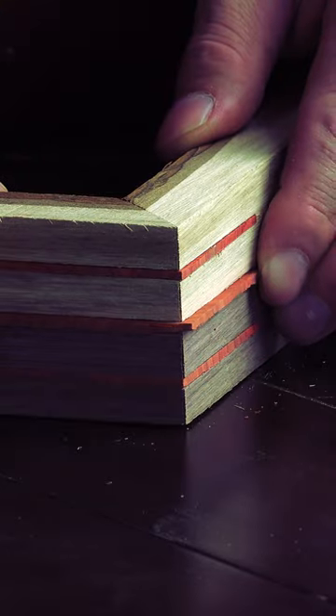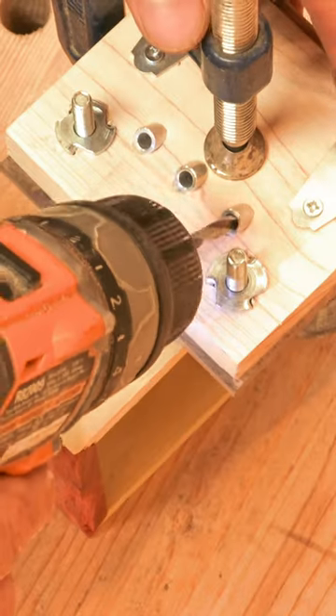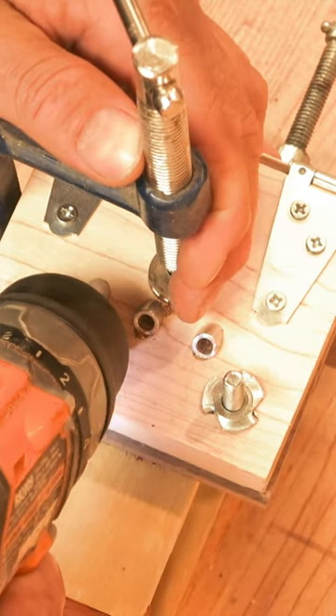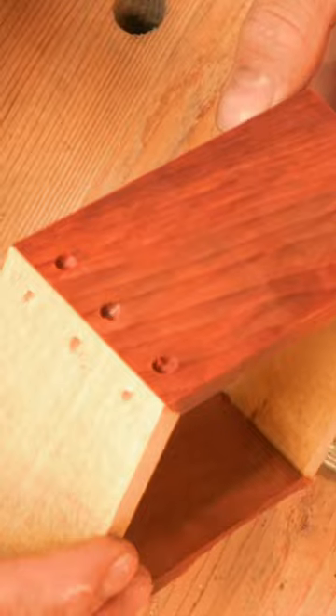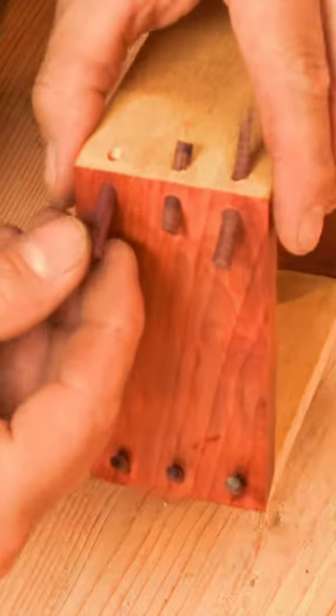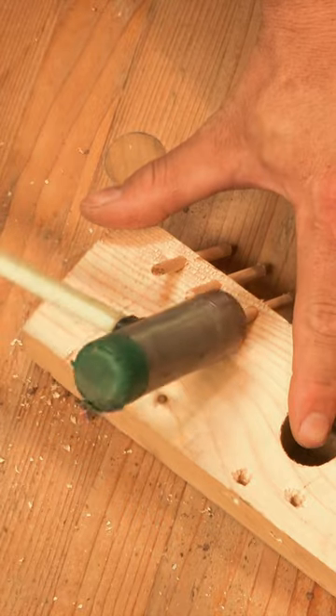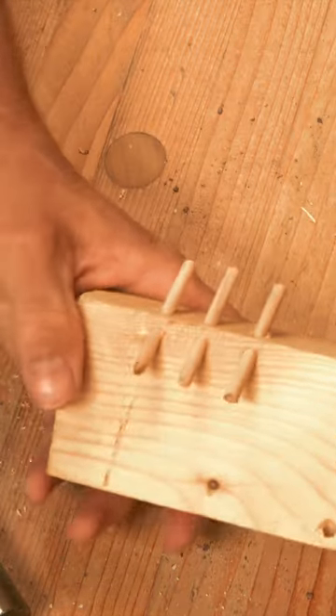Given time, normal splines can eventually break free. But let's look at how dowel splines are created. With this quick jig, I can drill out a few holes. These holes have a mechanical advantage as the dowels are angled inside the edge, locking the joint together. This edge will now not only have a glue adhesive to protect the joint from moving, but it'll be pinned in as well with a dowel.